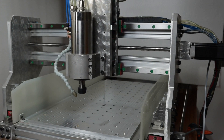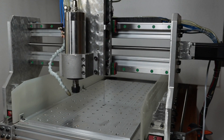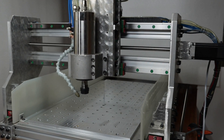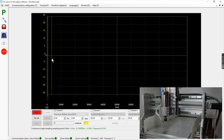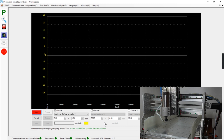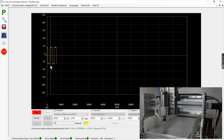Start the axis running — you could already hear a little bit of squealing noise. Start the oscilloscope again, and we see that we have right now a tracking error of about 50, and that is not acceptable.